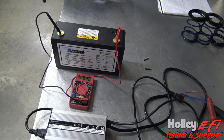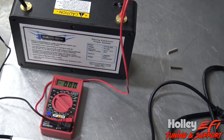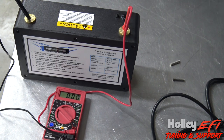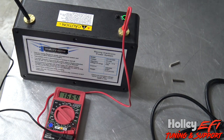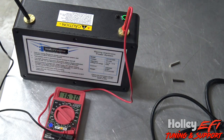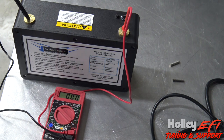The really cool feature about this is that you can shut this battery off - it's such a simple idea but it's so important. Bear with me as I only have one arm to use. The battery is dead right now at 0.00 volts, and I'm going to press the button. And there we go - 16.7 volts. There is a button, as you can see behind this probe, it's lit up green right now. When you press and hold it for a couple seconds, it shuts it off, kills the battery - 0 volts. So it is internally dead right now.